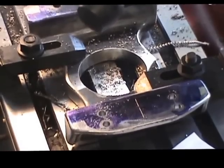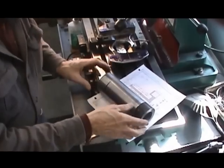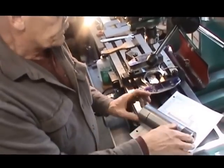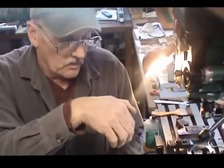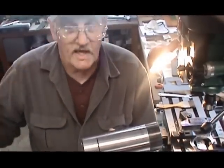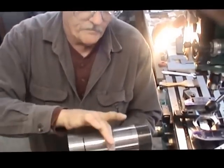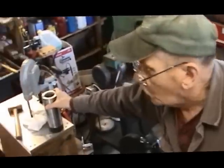Now, during assembly, for the finished pulley to run on this bearing surface, there has to be a clearance between the pulley and the finished bearing to provide lubrication room. Where this product uses a Babbitt bearing, what we have to do is provide a dummy bearing that is 10 to 15 thousandths larger in diameter than the finish. When we pour the Babbitt later on in this process, using the dummy bearing that is 10 to 15 thousandths larger than this, once that's disassembled, we can put that piece over this and we have the clearance that we need for lubrication. That process is over here in the lathe now.